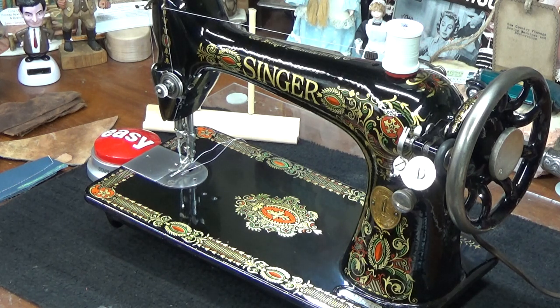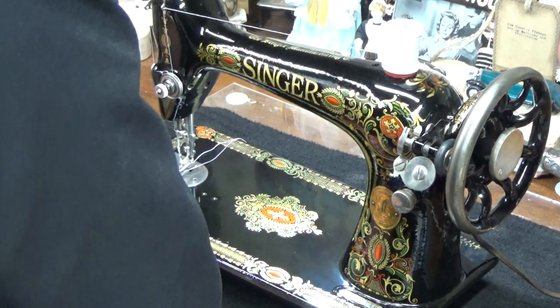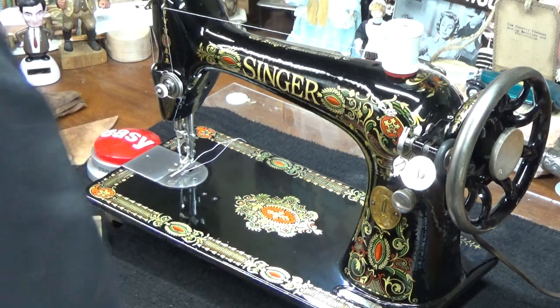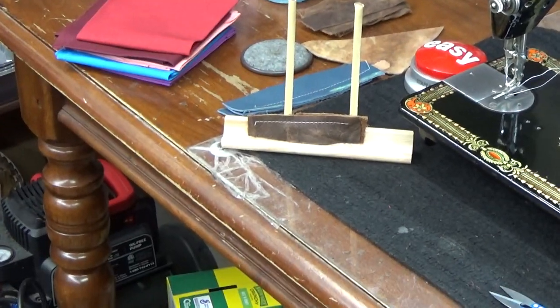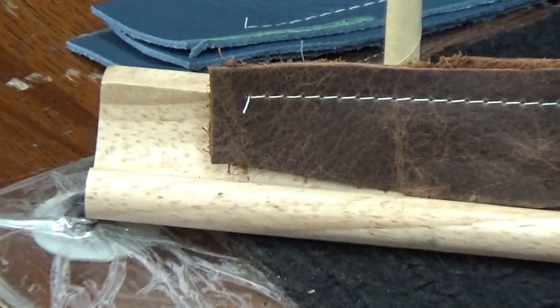No, I agree with you. I'll show you guys, I think that's an astute observation. Even as you change leather types, you might have to make just a modest, tiny little tweak on that upper tension. Again, if that upper tension has too much muscle, and I've talked to you guys about this before, it can actually make that lock stitch a little bit shorter, a little bit stubbier. Still going to be a beautiful stitch, but it's not going to be as good as it could be.